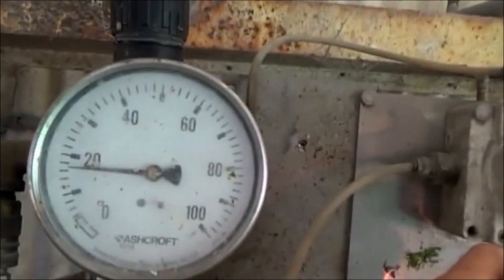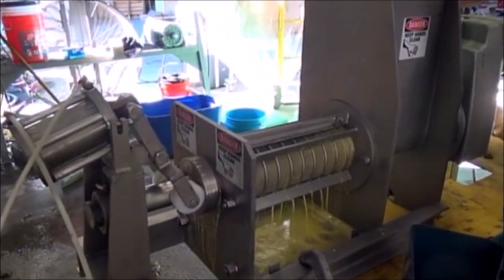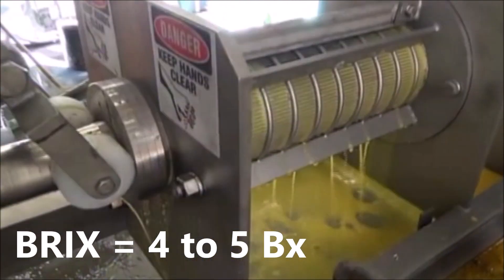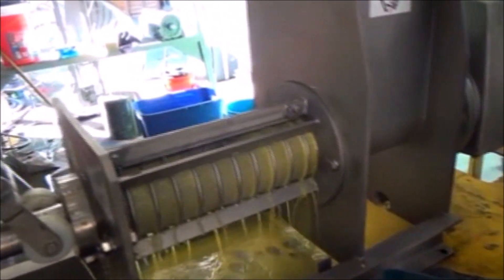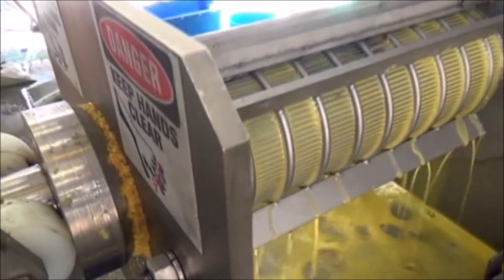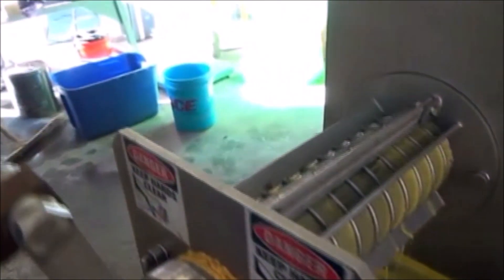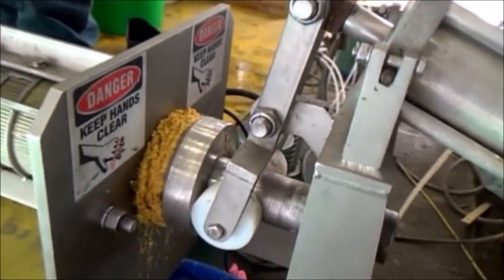I'm at one bar, and that's pushing it shut. Water comes out because that's just wet material that's been conveyed along. Are we getting the liquid out of this? We're starting to form a plug — look at that, forming a plug. Water's not running out anymore. And with one bar pressure, we're coming out pretty well.